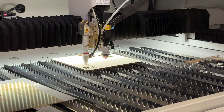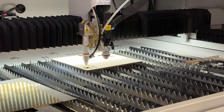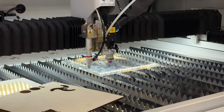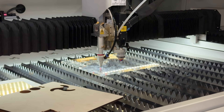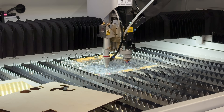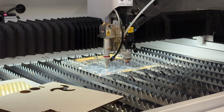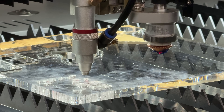All these pieces can come together — you can glue them — but one thing I'd highlight is that as it's doing this, notice at the very top you're not getting significant charring. You do see some flame on the bottom, which is why we spritzed the stones at the very bottom of the bed with some water. There is really little to no charring, which surprised me given the power of the CO2 laser. Keep in mind, 25 millimeters is how much you can cut. This laser is 1,400mm wide by 1,150mm deep, 950mm tall, plus the additional laser component piece that's 355 by 610 by 620. If you're considering something like this, you need to make sure you have the space.